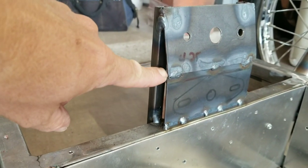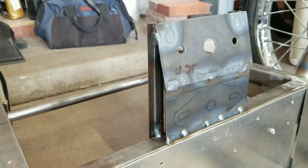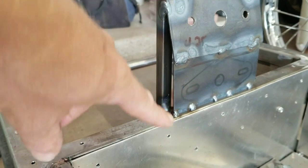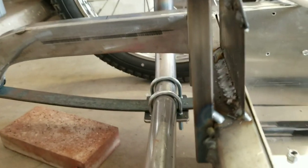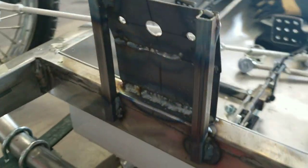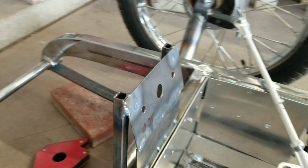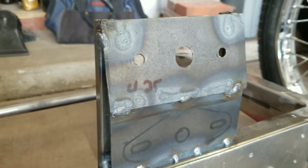So this is what I came up with. I just added to the plate because I had this angle anyway and didn't have a piece of steel big enough to make this all out of one piece and bend it. This worked out pretty good — I welded this small piece on, and my other bracket piece I already had welded to it, and I supported it with some half-inch square tubing from the backside. It is plenty solid and should hold up just fine. Most of the movement in this is side to side when the tie rods are banging back and forth, so it should not be a problem.